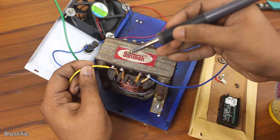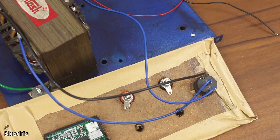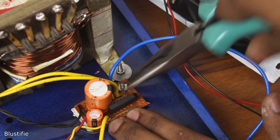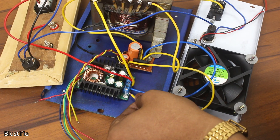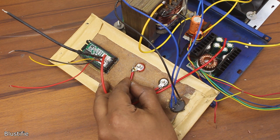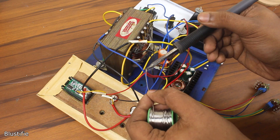Now it's time for the transformer to be set up. After screwing it to the body, I have soldered the power wires according to the diagram. The switch itself has an indicator LED — to power it, a neutral connection must be attached to the switch. I have also used the earth pin of the AC socket, directly connected with the body using the mounting screw of the transformer. The output of the bridge rectifier is directly connected with the buck converter. The output negative of the buck converter connects to the binding posts through the current measuring path of the meter. The voltage sensor and output positive feed directly to the binding post. The single diode rectifier provides power to the display and the fan.